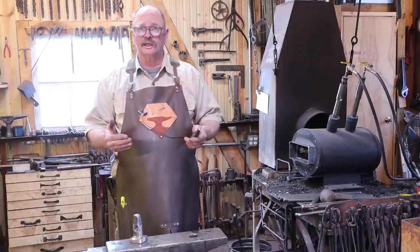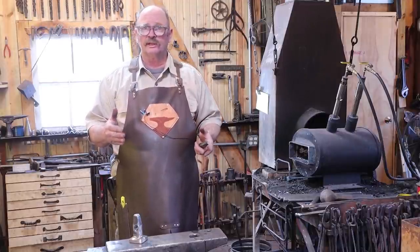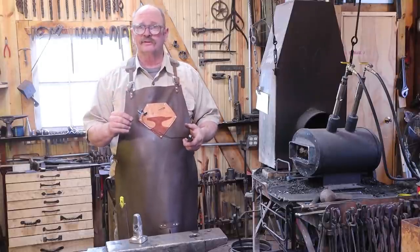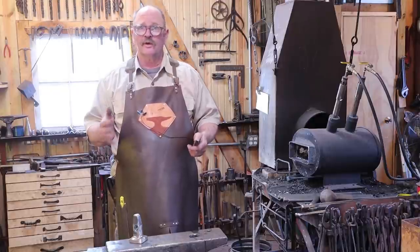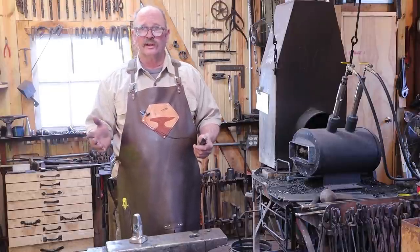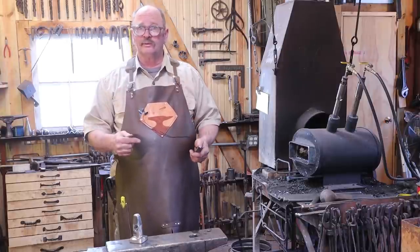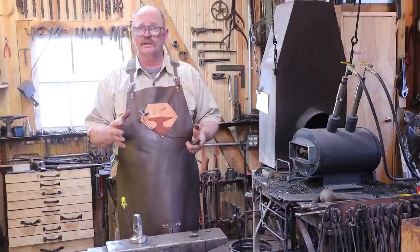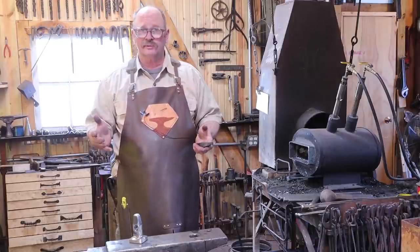This is as far as I'm going to take it. If I have small tool failures, I can adjust. Hardening it in oil gave me exactly the results I wanted. I will temper it at a little bit lower temperature than I might normally, just so I don't soften it too much, and we'll try it out. I'll work with the tool and see what happens. Anything that was stressed during the quench or the break test, I'm going to get rid of — that's been stressed too many times and will be unpredictable.